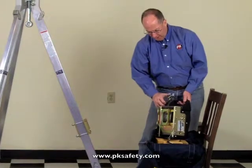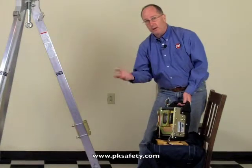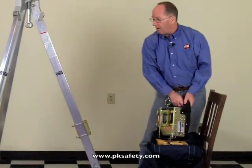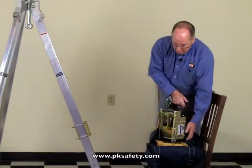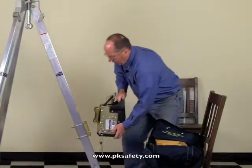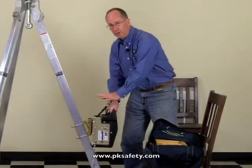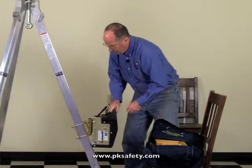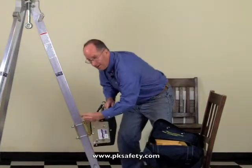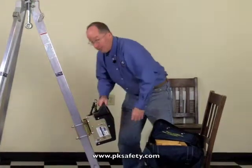This quick disconnect has been pioneered by DBI and really makes it convenient to take it on and off, because the tripod's not light itself, and you add one of these to it, it's pretty much of a bear. We'll just lower it onto the pins, and detailed pictures of all these pieces are on our website so you can see close-ups. Once on those pegs, you lean it forward, take this detent pin, put that in, and that thing's locked in place, ready to go.